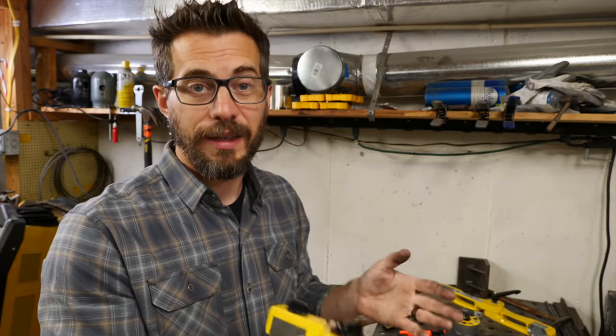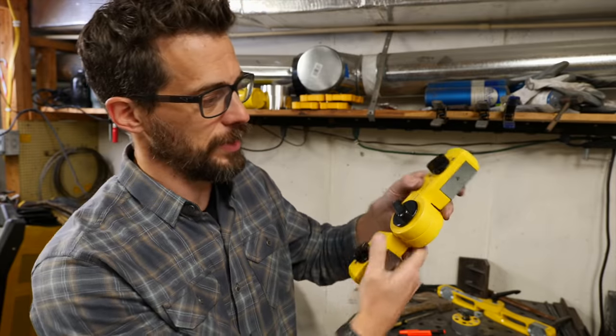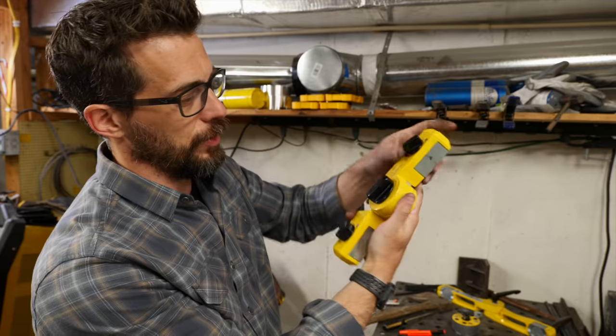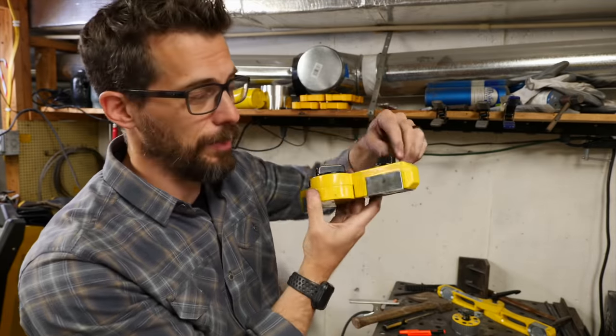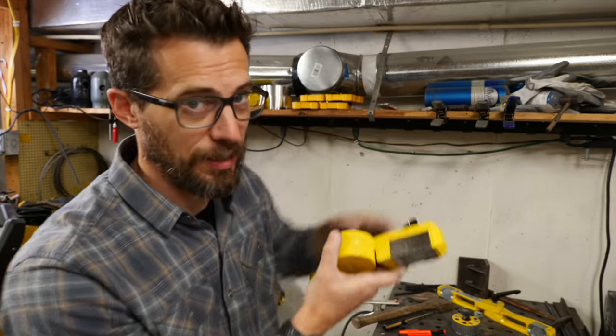I've got the frame cut down. I want to show you something real quick. This isn't sponsored, but my buddy Andy Klein, who's an awesome inventor, sent me these really cool things to check out. They're called mag switches. Basically they're fixtures that you can put on any metallic surface and they have a dial where you can set the angle that you want the pieces to be at, then you tighten it down, and when you set it down on a metal table and turn these knobs, it engages a magnet.